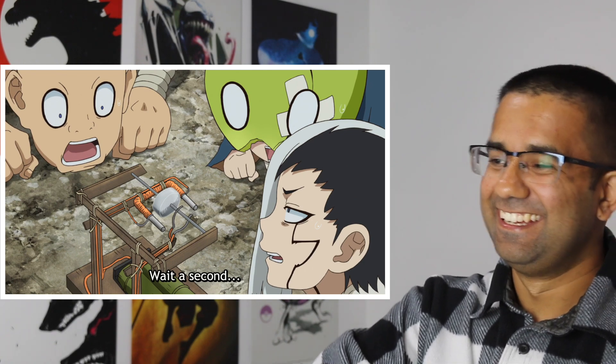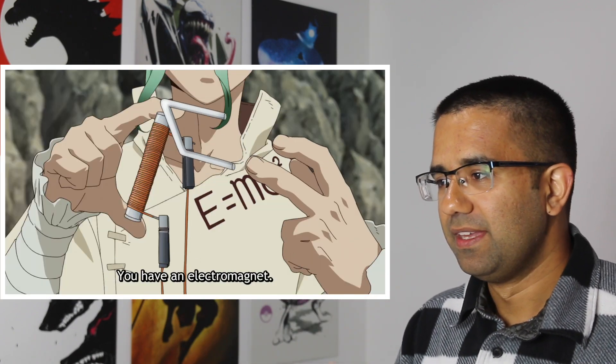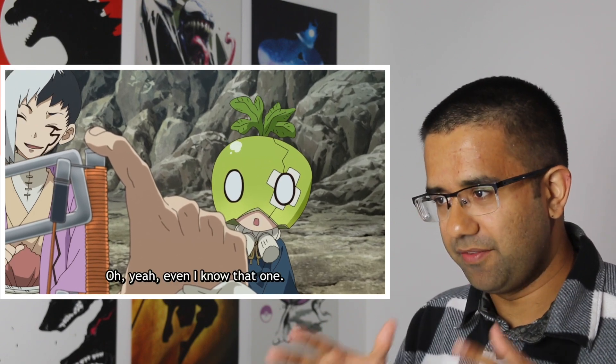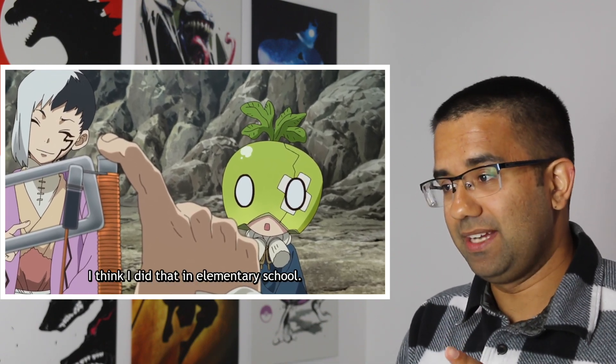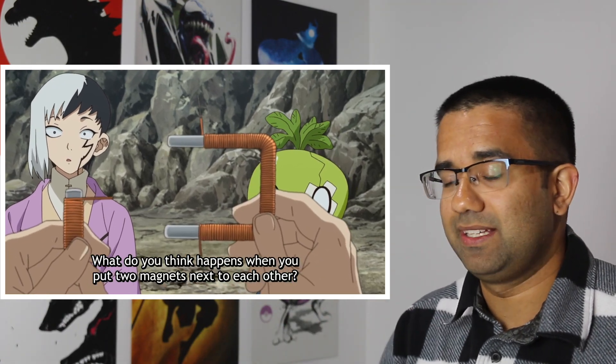This is the most bare-bones motor I've ever seen and it really will work the way Senku has shown. The magnetic poles are always opposite and opposing each other, which is why the smaller secondary magnet is spinning. It's important to have one of them in a fixed position because if it wasn't, both electromagnets would actually spin until they're sticking to each other and you'd just have one really strong magnet — not one rotating in the magnetic field of the other. This last part is so true; it's what we were talking about earlier with multiple coils yielding a stronger magnetic field.